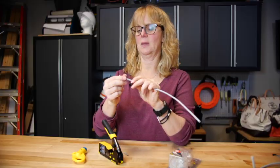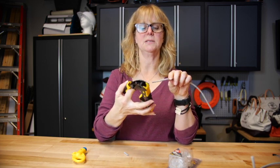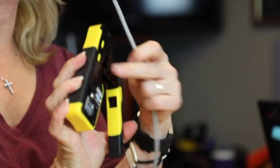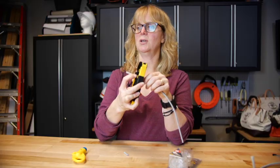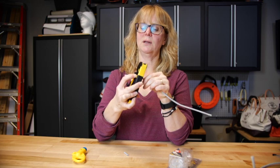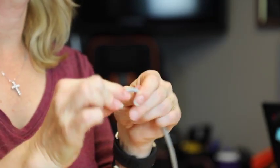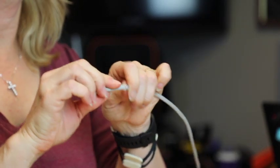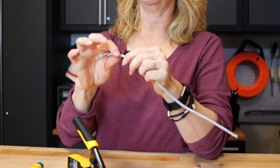Remove the Kevlar string. When you're ready to strip, you place the wire into the strip nest, tighten it, push it up slightly, rotate it through, open the crimper, and bend it back and forth. It will not damage the jacket.